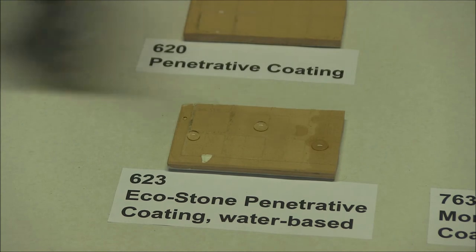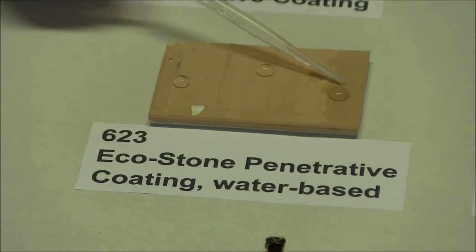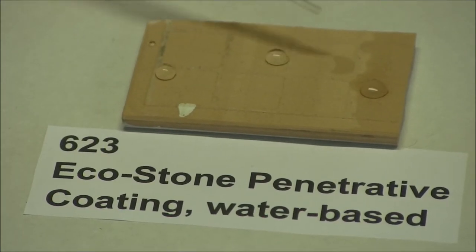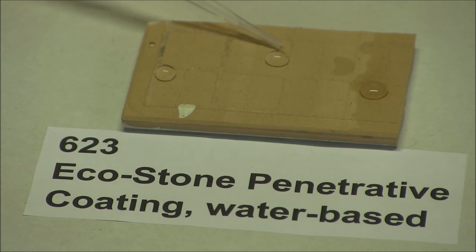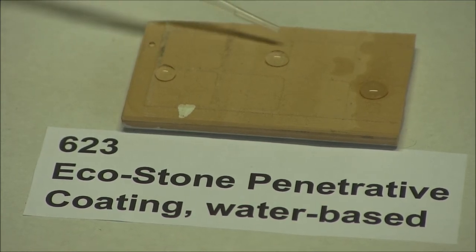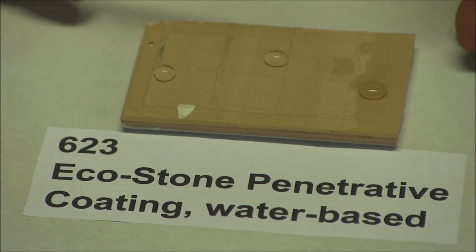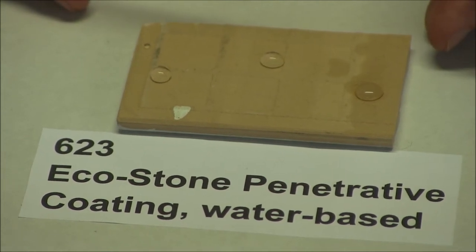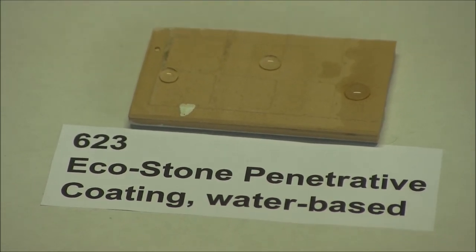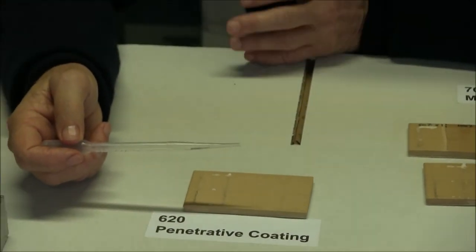And in fact, you'll see here that it's not absorbing into it, but this has a lower contact angle than here because this is cured. As I say, this was only done yesterday. These have dried out more quickly, which is interesting, because that is very, very stain resistant. Hardly any water uptake. We've tested this extensively, but very flexible. That's the beauty of this with stain resistant characteristics. Right, moving over to the 620. The 620 is a fixed product. We can't dilute it.